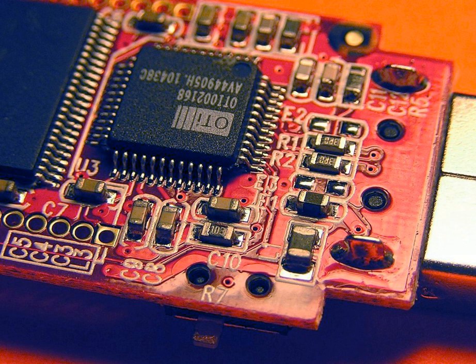However, most electronic assemblies are made using a no-clean process where the flux residues are designed to be left on the circuit board, since they are considered harmless. This saves the cost of cleaning, speeds up the manufacturing process, and reduces waste. However, it is generally suggested to wash the assembly, even when a no-clean process is used, when the application uses very high-frequency clock signals in excess of 1 GHz. Another reason to remove no-clean residues is to improve adhesion of conformal coatings and underfill materials.